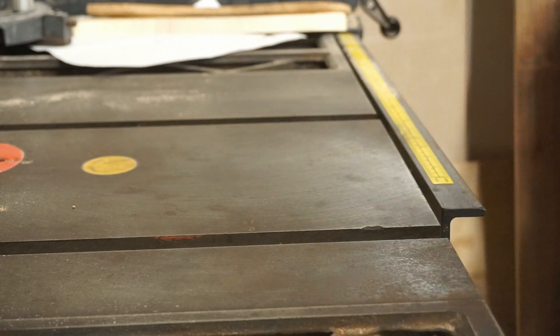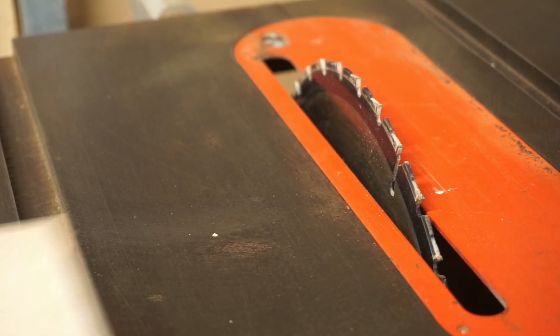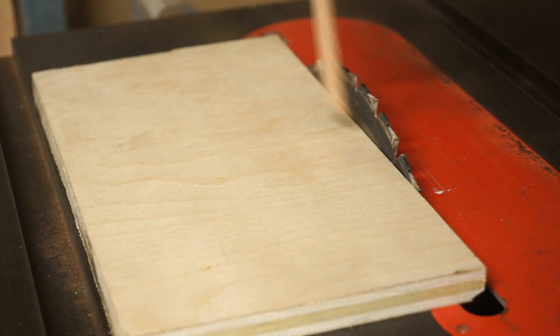At first, what I thought I wanted was a zero-clearance insert for this new saw, but that only solves half my problem. I still don't know how I'd hold these siding boards both precisely and safely. So I thought about it for a while, and eventually a solution came to me. Instead of a zero-clearance insert, I'd make a sort of smaller plywood table that would sit on top of my existing saw. I'll clamp this fixture to the saw so it won't move. This fixture will have a zero-clearance slot, and will also have some specially shaped guides to help hold the board down. The advantage in making a secondary table gives me a place to mount these guides, which will be critical to ensuring the board stays lined up.